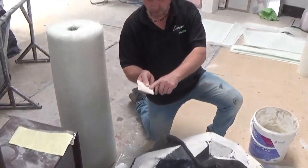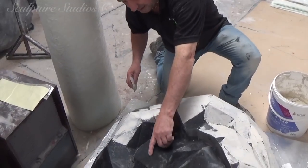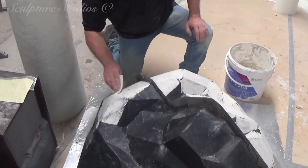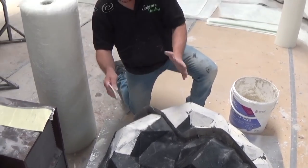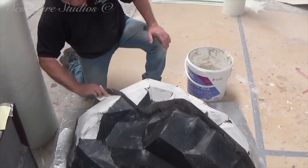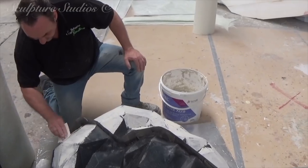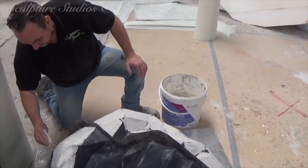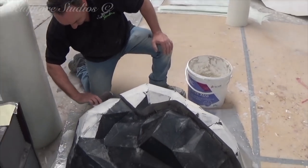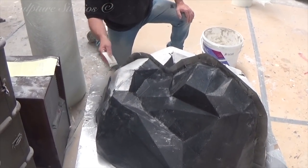The idea is we're using a water-based plaster to clean up the surface and lose all that polystyrene texture with its little dents. We can rub this back once it's air-dried, which shouldn't take too long, and just clean up the surface as we move along so it gets better and better. Water-based plaster filler — which we get asked about a lot — you can buy it in large tubs from home construction stores. It's not particularly strong, but it's good for finishing a sculpture aesthetically. Don't use it to strengthen the sculpture; at this stage it's just for smoothing the poly down ready for mould making.